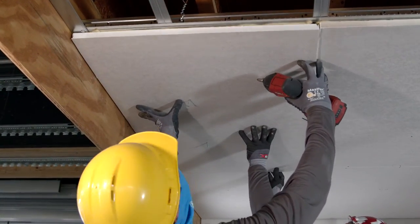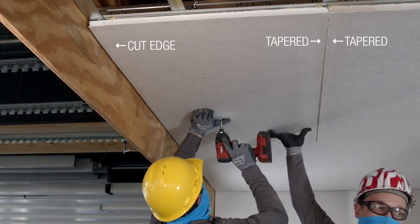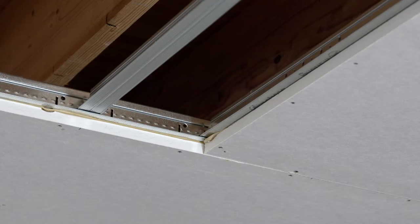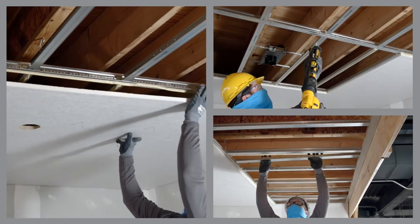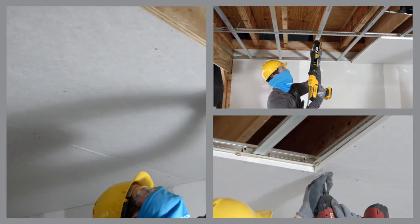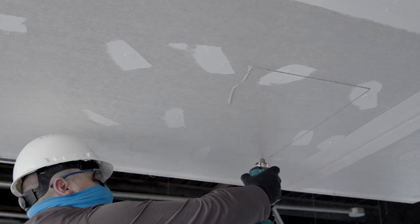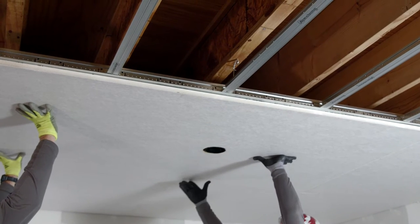Acoustabilt panels are tapered on all four edges. When you install cut panels, orient them so that cut edges are positioned only at the walls or against fixtures — where panels butt each other, use only tapered factory edges. Continue adding panels to fill out the entire ceiling. For every second panel in a run, install an extra tee. Be sure to have a grid member behind all four edges of every panel. Remember to press the panel firmly to establish a strong bond with the adhesive. Cut openings for MEP using a utility knife or roto-zip. When installing a cut panel, dry fit to confirm the cut before applying adhesive.